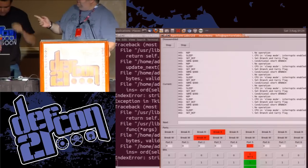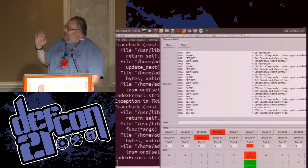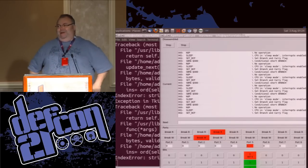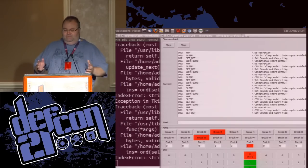Thank you. Sorry. Just before we go to questions, one of the cool things about this was the manufacturer was so secure in their belief that no one was ever going to get the data off this chip. Oh, it's mask ROM. No one can read mask ROM. Once it gets its fuse blown, there's a diagnostic routine that allows them, once the chip's assembled, to verify the code, and then they blow a fuse and it's gone. So you couldn't possibly do it.